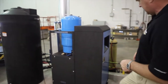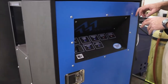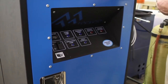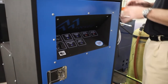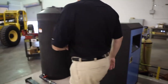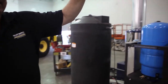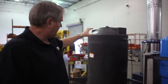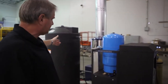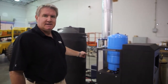This is a new product for Landa. It has a built-in transfer pump, a built-in circulation pump, built-in auto water fill, and built-in rainwater overflow. This is a separate modular component we're putting at the end of the system. We also put an ozone generator on it. This is our finished water tank — by the time it gets done through all these processes, we've got finished water here getting ready to be fed back to the pressure washer. We're ozonating this water, which keeps the odor down, breaks down some chemicals, and helps with sanitizing.